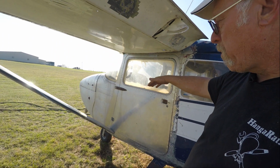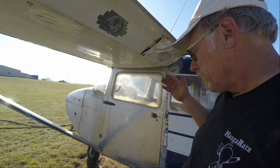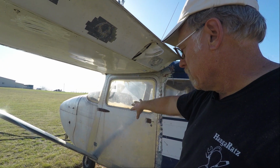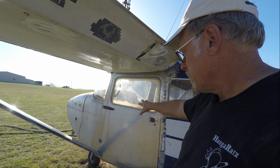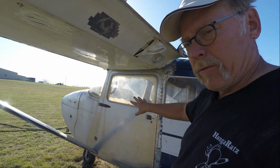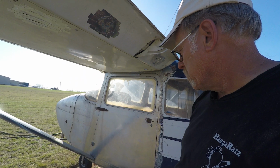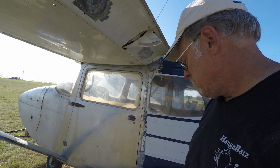The forward part of the fuselage, we went and stripped it, and I probably shouldn't have, but I stripped it, and then the project kind of paused. So what we're going to do there is take the hinges off and the latches off, because they end up getting rusty. We'll take those off, retreat them, reprime them, and then reassemble them, to make sure we don't have any corrosion in between those where that hinge goes on. So that'll be all done properly. It'll get, of course, new windows.